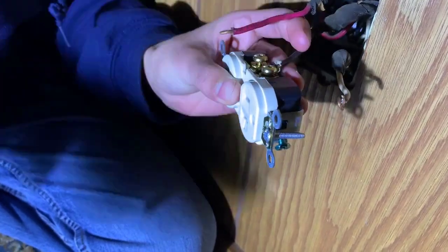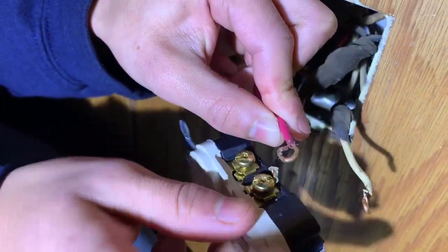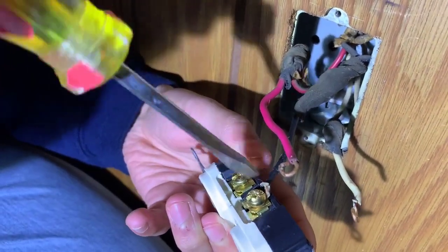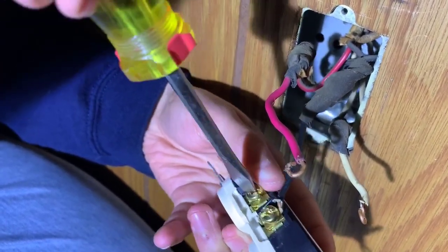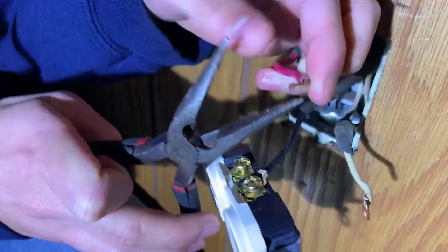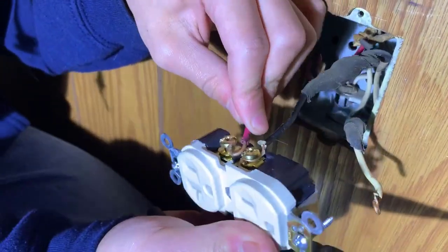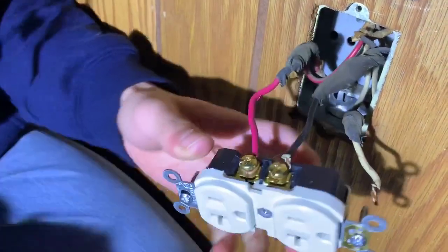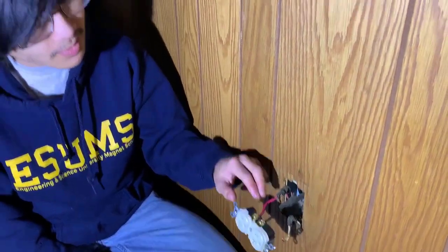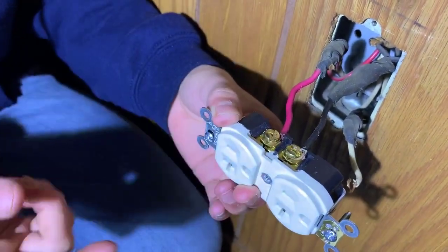If you're dealing with a wire where the opening is too small, then you can either open the opening or loosen the screw. I think this opening on the wire is a bit too small for it to still fit through the screw, so we're going to take a needle-nose plier and open it up just a tiny bit. There we go — now we tighten that. We've got the live wires done. Make sure that when you tighten these, it's tight enough and that the wires make contact with the metal.